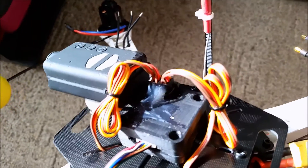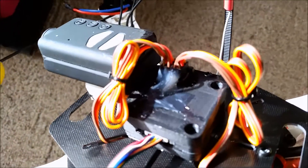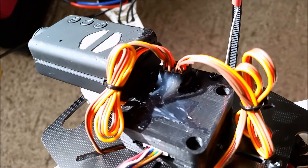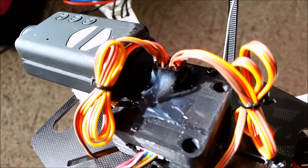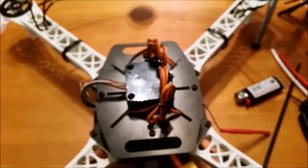I had some of the wires popping out, and you don't want that to happen while you're flying, so I used a little bit of silicone in between the plastic connector and the case for my CC3D board. We've also cleaned up the CC3D board wires using a zip tie, so everything's nice and tidy and doesn't jerk around.